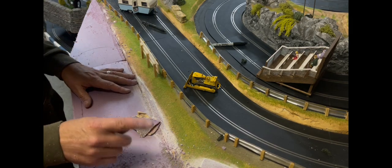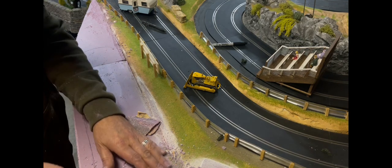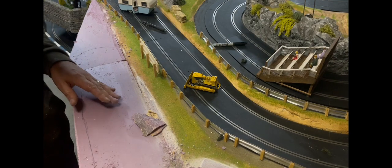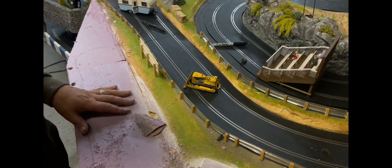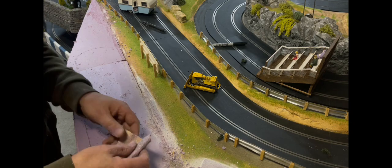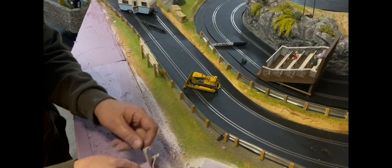Now, those areas where we put the screws in, some of these remnants you can use as filler, just put it in there and clean it off over the side. So when we come back with our joint compound, it will bridge right over the top of it. But what I'm gonna do is just take this sandpaper and bring this down. Sandpaper is getting worn out.